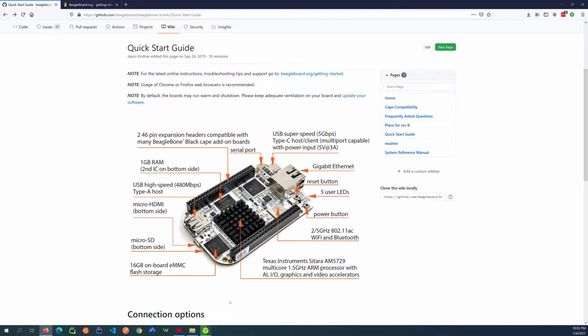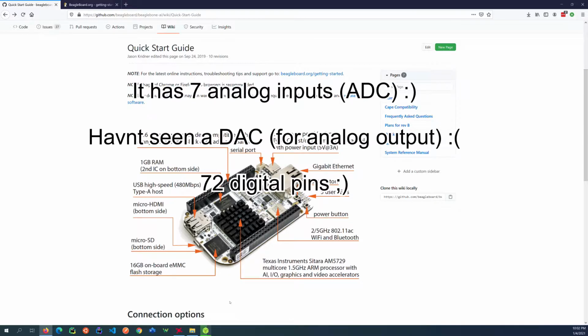So you get a lot of the really nice features that you get with a microcontroller, where you have a lot of control over some hardware that you put on there. It also has some analog stuff. I believe there's analog outputs on here as well, so I imagine it's got both DACs and ADCs, right? So digital to analog converters and analog to digital converters, and the ability to put out an analog signal. So if I want to drive some audio, that would be nice too. And the fact that it's open hardware, again, is pretty nice.